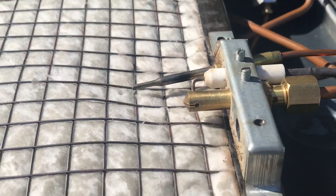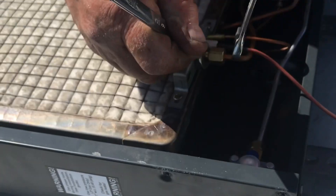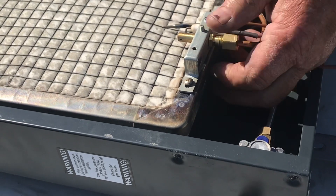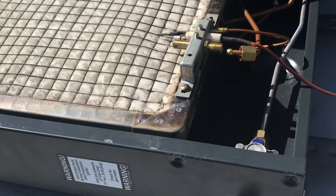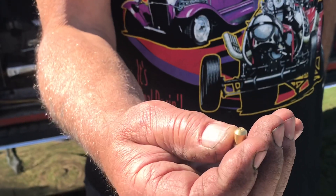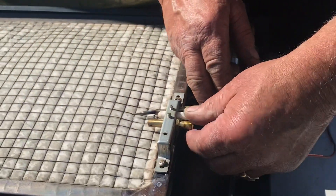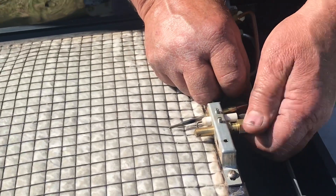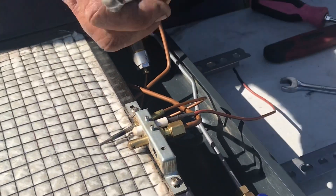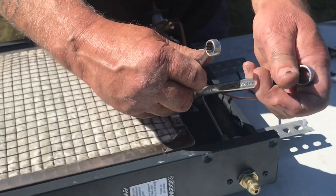Just remember when you take this off — this line here — you have to hold it with a dummy wrench and take this line off. Right inside there — look at this — that's an orifice right there. If you don't put that in, it doesn't work. Trust me on that. You just put that back in. If you've sort of screwed that up, it's just an ordinary quarter-inch compression fitting, so you can put a new nut on there if you want.